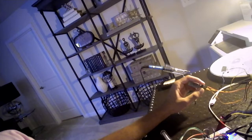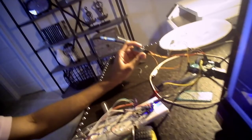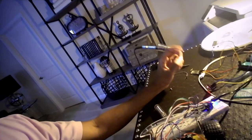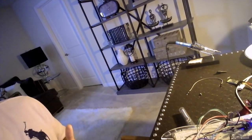This is the HC-05. This is the Bluetooth that allows this to communicate to this, even though they're not connected to each other. I had to upload a serial code to the HC-05 to really get them connected, and I had to put it into AT mode to get them blinking. But my original Bluetooth modules did not work.